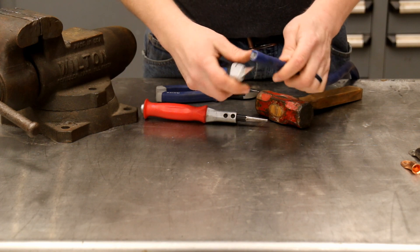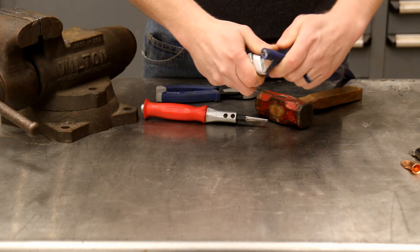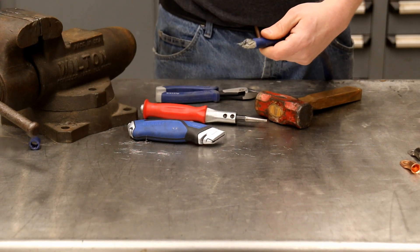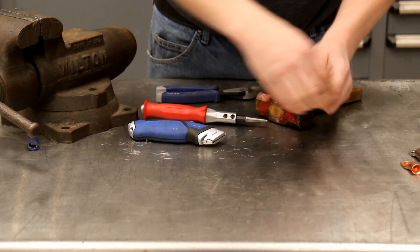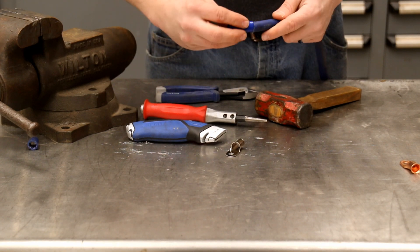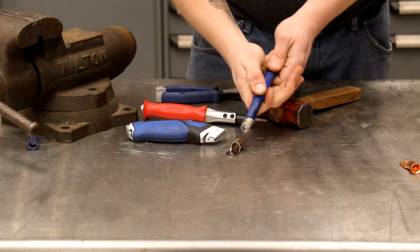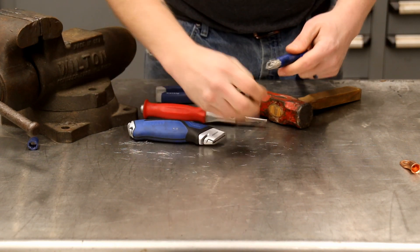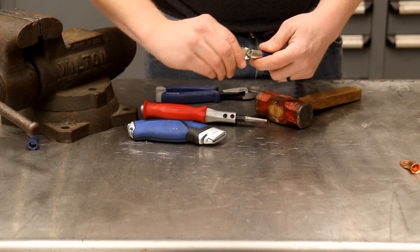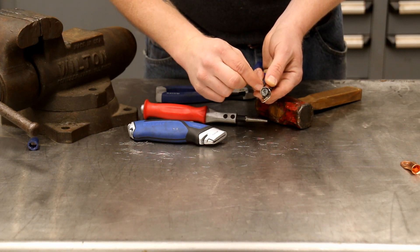There are a couple different ways to cut this, but the easiest way is to be really careful and slice the outside edge just barely with a razor blade. I like to twist the end and peel it off — you will always get some strays, don't worry about that too much. For this one we're going to use the split ring. You want to slide it on before you cut — I always forget to do that. Slide it on, twist a little bit, then take the terminal and go with the twist to eliminate as many frays hanging out the side.